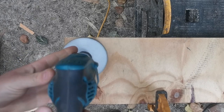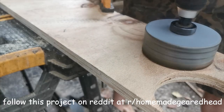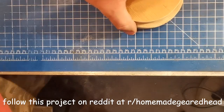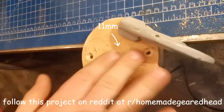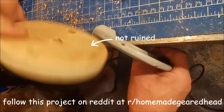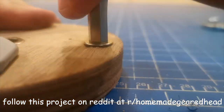To make the hand wheels themselves, I've used a four and a half inch hole cutter — the kind plumbers use to fit drain pipes through walls. If you're using cheap plywood, the trick is to start from one side until the centre drill goes right through, then finish the hole from the other side. For the next step, you need to drill two extra holes 12mm from the edge, starting with the pilot hole. These are for the M8 inserts and eventually need to be 11mm diameter. On the final pass, you'll find the drill tries to chew its way through — instead, if you run the drill backwards, it will avoid snatching and give a much cleaner finish. Be careful when you screw your inserts in; take extra care that they go nice and straight or you end up with a wobbly wheel.